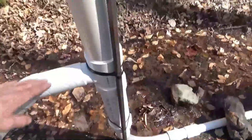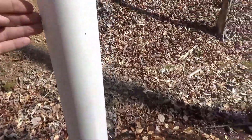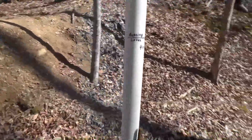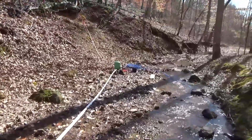Up here we've got about 20 gallons, and if you come on up further we'd probably have about 15 or so — still plenty enough to feed the ram pump. This could actually be retrofitted: if you wanted to change yours, you could just bring your line up, put an elbow in it, come up the pipe and turn in this way, using a tee or a rubber grommet — either one would work. And this would increase your water velocity for your ram pump. Thanks for watching the video.